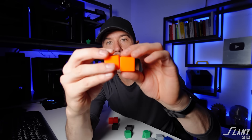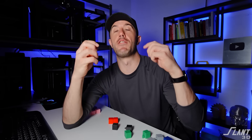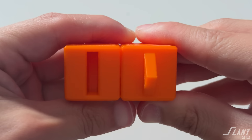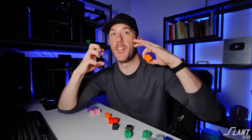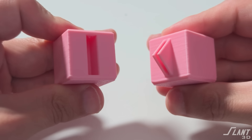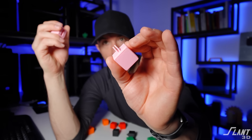With a couple of tabs slightly offset you can ensure self-centering and avoid misalignment. This gets a really good fit rather than a potentially loose or too-tight fit that relies purely on material precision - which always varies based on print settings, materials, and machines. For even more robustness, instead of a solid slot with set dimensions, use two flexible tabs that always fit into the slot with a little pressure on the outer walls. Since they can flex quite a great deal, regardless of what machine you make them on, they will always work.